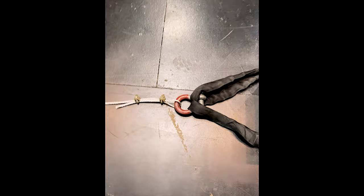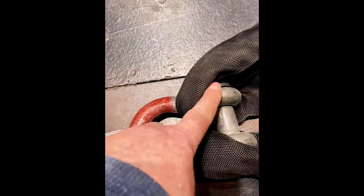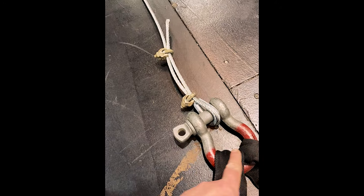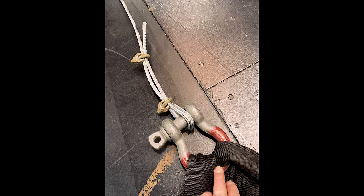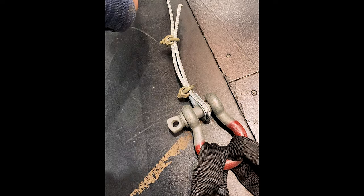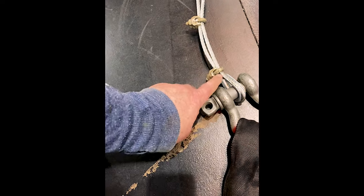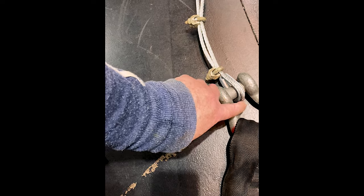There was initial suspicion about how they got the thimble over the end of the shackle — but then it was clear they didn't use a thimble at all. Now this is better: the shackle is oriented the correct way. The bell part of the shackle is designed to attach two or more points where forces apply in different directions. The pin is designed for a single point in a single direction — never put two points on the pin. With the thimble now attached, there's no pinch point pressure on the cable; instead there's a gentle curve designed to carry stress around that joint.